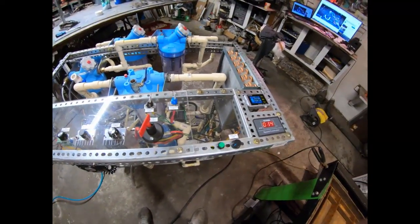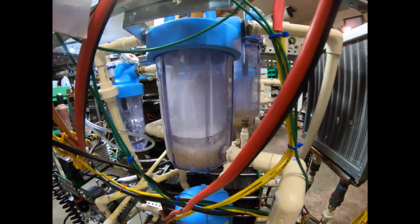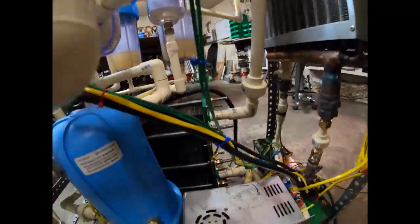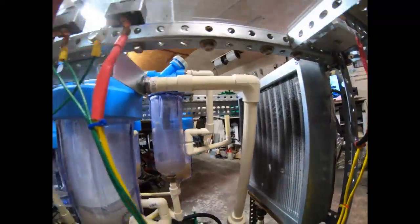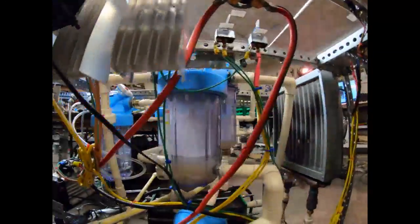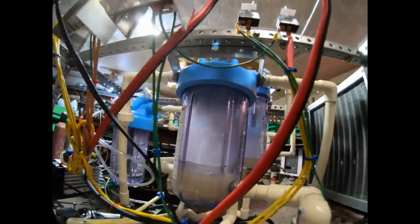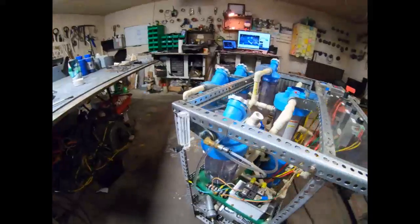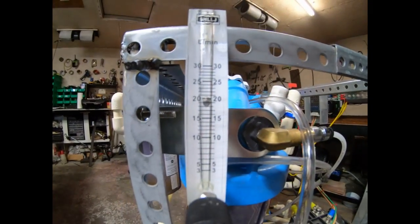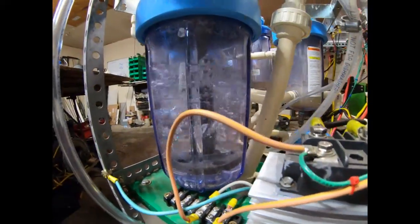This is in 4K — I've never used this camera for this before. The fluid you see being pumped right now is being pumped by bubbles alone. You can see the discharge of both sides of my electrolyzer — both legs feed into an area there and are both ejecting fluid. Let's get a look at the amount of bubbles we're producing. The rotometer is right at about 20 liters per minute, but we know that's wrong — it's a fairly furious amount of gas.